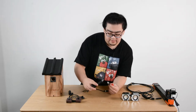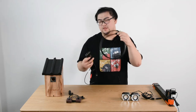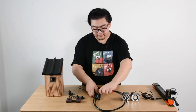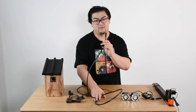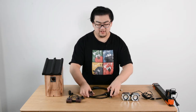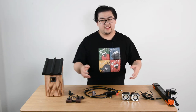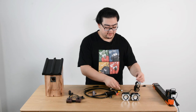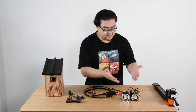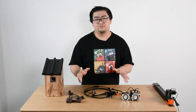So we use this to connect the HDMI bird box camera to our converter. You can see, like conventional analog cameras, there's power, power audio, and then video. Connect the audio to the input right here, and then we use an HDMI cable — really common these days, really easy to purchase, and it's not that complicated to use. Connect it with our converter, and then simply connect this to one of our monitors, our TVs, anything that has an HDMI port. So this is the whole kit. We do have these HDMI bird box camera bundles coming with all of these. Because it's like an analog system, we have to use an external speaker to let the sound come out. But it's not that complicated, because if we have experience with analog systems, the extra sound system will already be existing and everything else will be very familiar to you. So not hard to operate this setup.